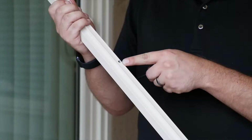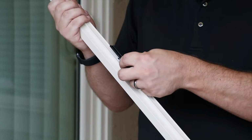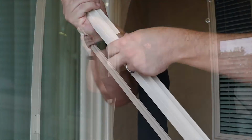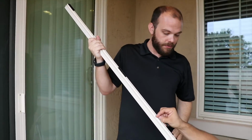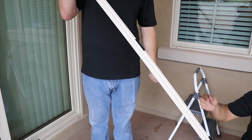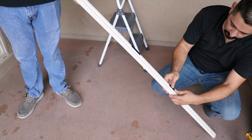If your main patio door is equipped with a pocket that is deeper than the latch jam extender mounting leg, attach the shims provided in 5 places on the back of the mounting leg until the latch jam extender clears the edge of the pocket and installs flat in the bottom of the pocket.